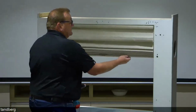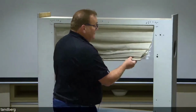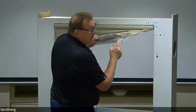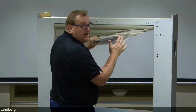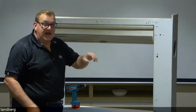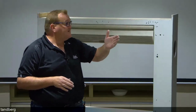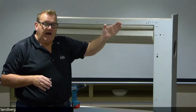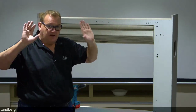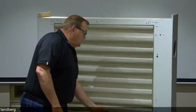So you can actually see, and I might just pull that out from the side, actual fabric puffing out at the back and puffing out at the front. So obviously for a big stack fitted on face, you may need to use some extension brackets or some spacer blocks to move that away so that it's not rubbing too much on the architrave or any window behind it. There you have our Luxaflex Modern Roman Shade range, traditional, tailored and tiered.